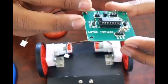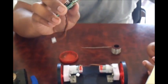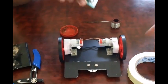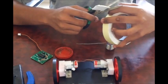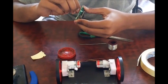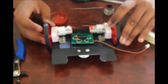Now I am going to be mounting this board onto the car using double-sided tape. I do have mounting holes on the board but I am not going to use screws right now for simplicity. It's pretty simple — you tear off some tape, one side is adhesive by default and the other side is protected by a coating. Stick the adhesive side on the board and peel off the protective layer to expose the second adhesive side. When you put this on the car, be careful not to press it too much so that the soldering joints do not touch the metallic plate — if they do there might be a short circuit.